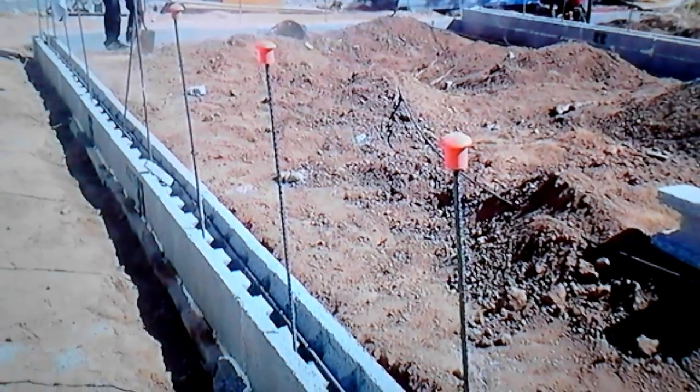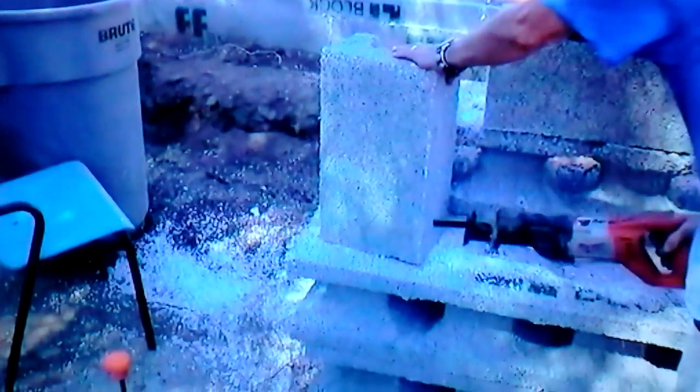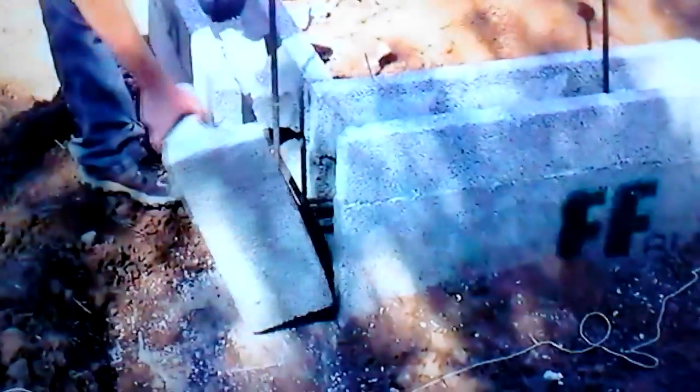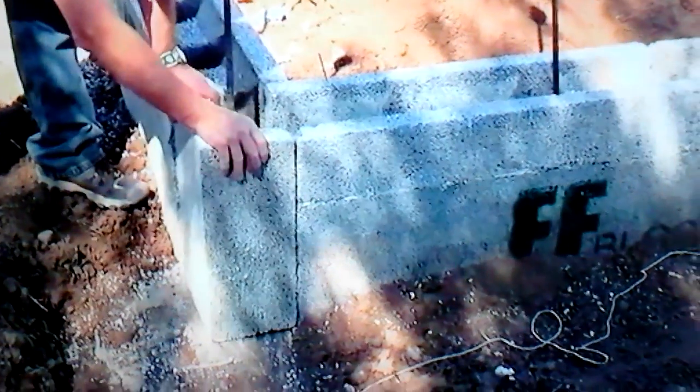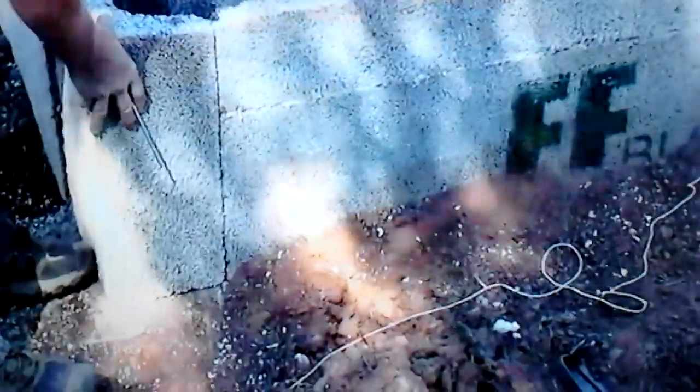You can see it's 18 inches on the top of the screen and not quite on the bottom. Here's how you do the corners: either by the corner of the end element, cut the ear off, set it where you want it, take a six-inch galvanized or aluminum gutter spike and push it in, hammer it in, then take your glue gun and glue it.